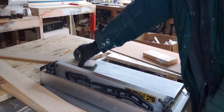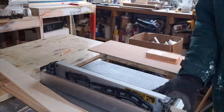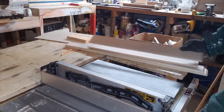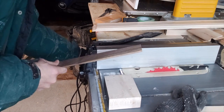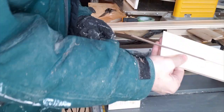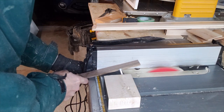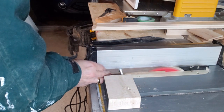I'm cutting the top grooves a little looser than they need to be, because I have to glue the bottom panel in first and add some pieces for the inside drawers, and then add the top panel after. I was a little worried that getting the top panel in was going to be difficult because it was so large, and once the bottom panel is in place there'll be hardly any give in the frame to help slide the panel in.